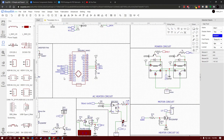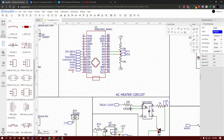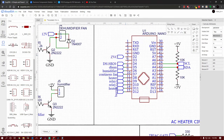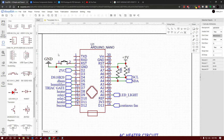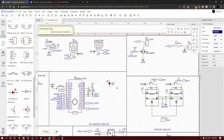Now that we're done with the complete circuit, I'm going to clean up the schematic and connect any wires or ports I forgot. There's another problem we might need to tackle: when the circuit is replicated on a breadboard or PCB, if the microcontroller hangs you'd either need to pull the whole plug out or open the box to press the reset button. Let's make resetting easier on the Arduino by connecting the reset pin through a button to ground. When the button is pushed, the reset pin is directly connected to ground and the Arduino automatically resets. We can bring this button out to the front of the case for easy access.